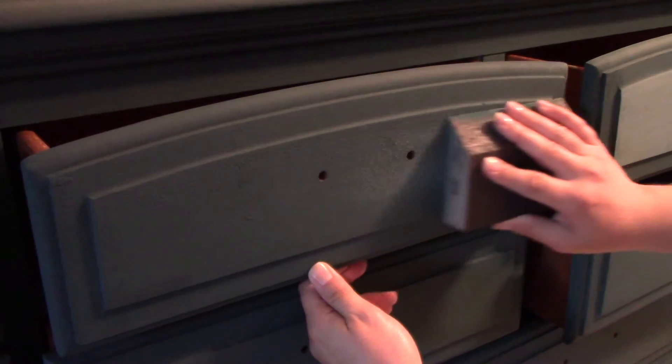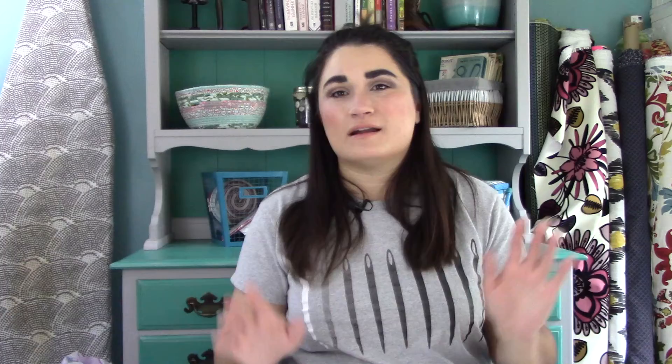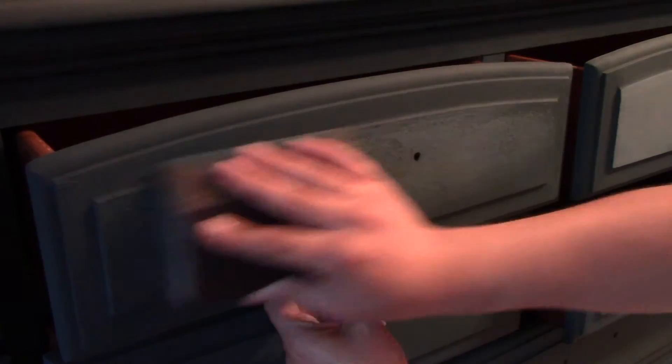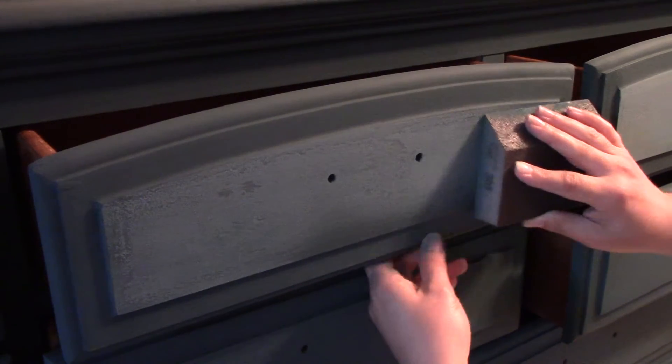I talked about when I got to the bottom of that can, how things were getting a little thicker. I don't know if it's because I bought the paint last fall and finally got around to using it this summer — so about nine months later — or if I didn't stir it up enough, or if this is just how this paint is. When it got to the bottom, that paint got a little thicker and I had a lot of issues where it just wasn't as smooth; it looked a little bumpy and textured, which is not what I wanted. At first I thought I'd just leave it, but then I was like, no, I can't — this is my grandma's piece, I want it to be nice. So I took a fine sanding sponge and removed texture, not paint. Once I added a little bit of water and stirred it up, it was fine with no more issues.